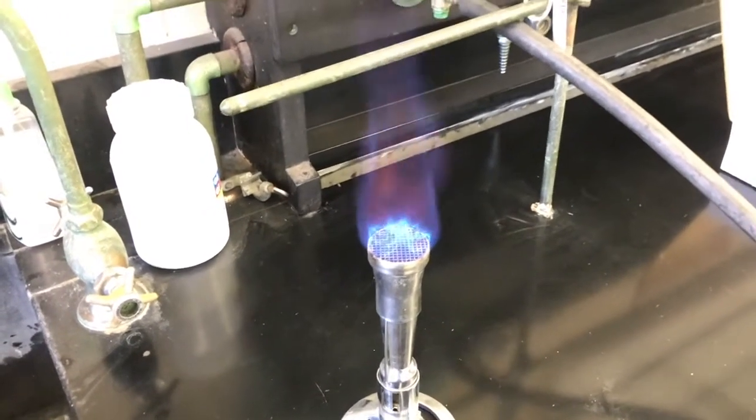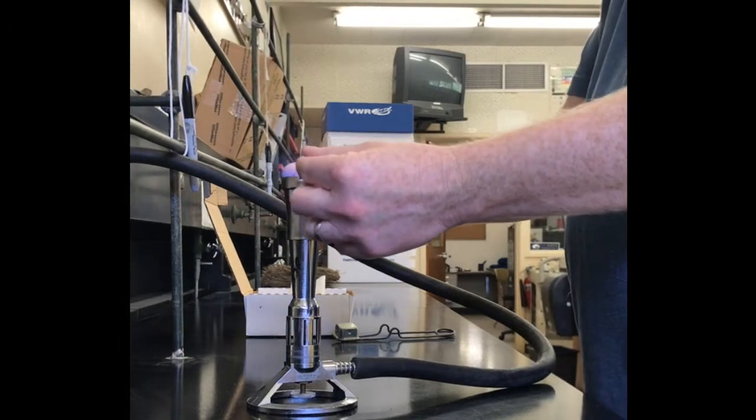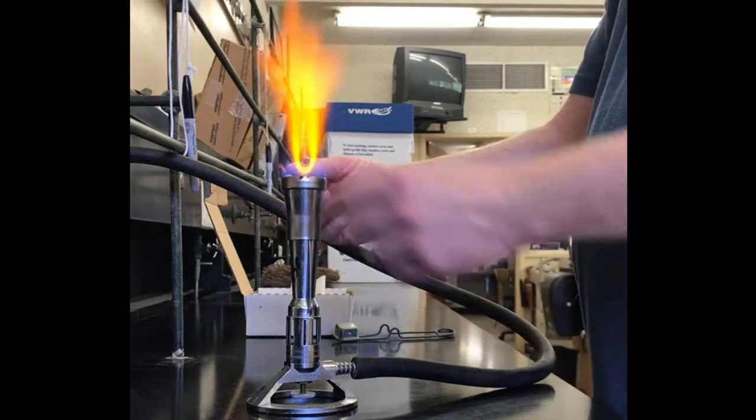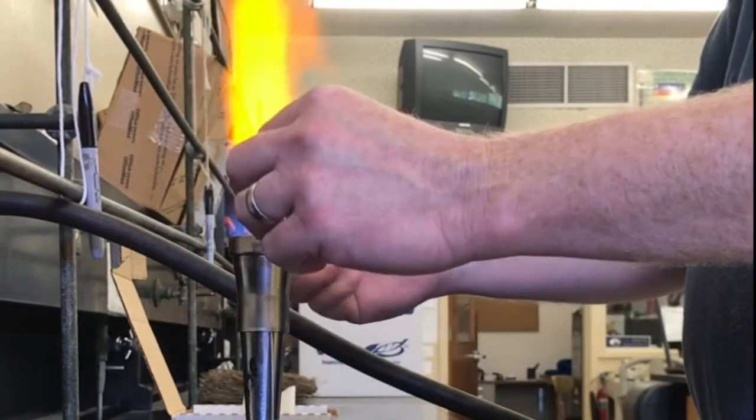A lot of students say this is the favorite part of the year. I'll put my pipette in the blue jagged part of the flame - the really hot part - and keep heating it and twisting it, not letting my hands get too close. Once the pipette is orangey and starts to look melty, like a Salvador Dali picture with the melting clocks, I step back and pull fast. Now I've got a nice long thin pipette - the middle section is the capillary tube. The outer parts are very hot but the thin middle has cooled due to greater surface area. I'll set it down to cool.